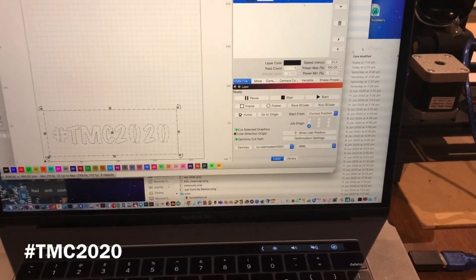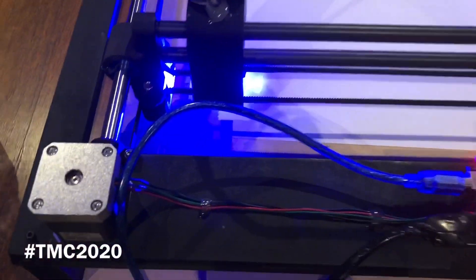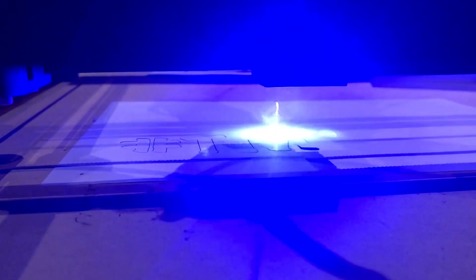These designs I'm putting together are going to be shared on Thingiverse. They are my designs based on an original preparation from somebody who had an instructable — I'll link to the instructable and also to the Thingiverse designs down below. I've used the GRBL open source firmware for doing the CoreXY motion control. I've also made the designs parametric in OpenSCAD, which means that if you want to use different size rods, different size bearings, different spacings, or have a different sized opening, you basically just plug in the different numbers and off you go.